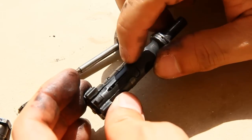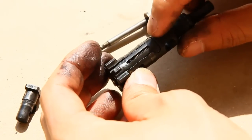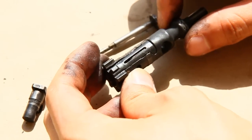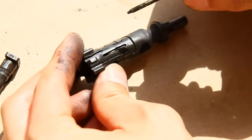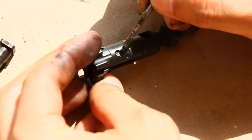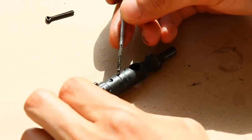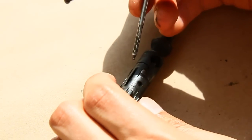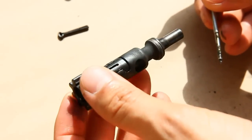And also they changed the lobster tail extractor design. Inside they have dual extractor springs to enhance reliable ejection of the casing. Also you can see here, that's a detent spring to hold this pin in place. They also moved the pin a bit forward to enhance the extraction of the rounds. So that's the complete E3 bolt design.